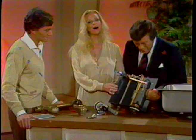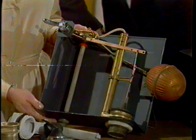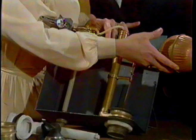All right. Now what we've got here. What the heck is this? Some of you recognize this little number. I know what it is. This is your good old toilet tank. Now, a lot of times you don't need to bend this thing here, the ball cock, when the water's running up through here. Sometimes that isn't always the right thing to do. You just do that to set the level of the water.